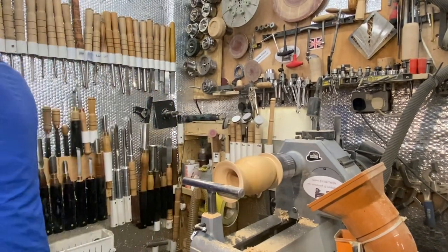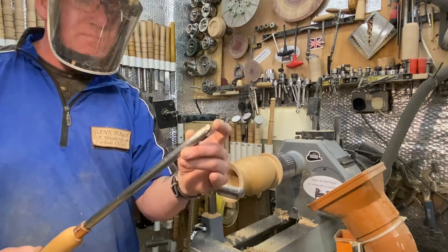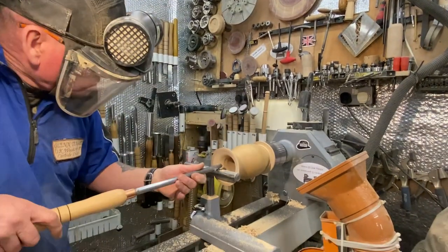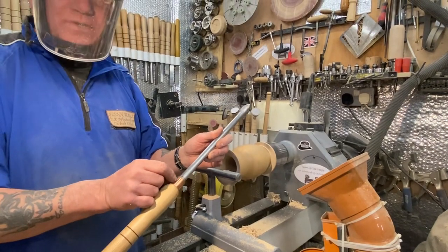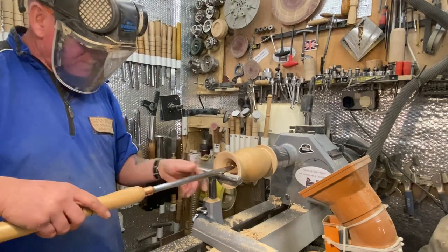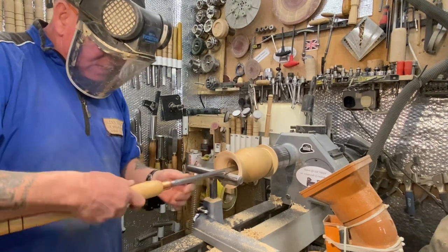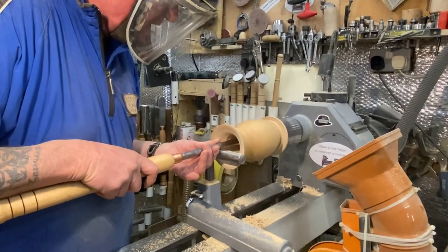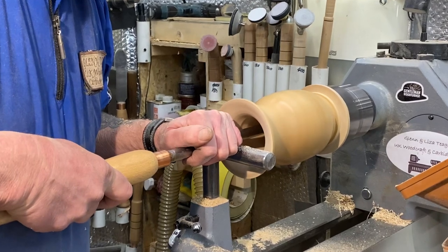But for me, when I'm doing deep hollowing, I prefer the 10mm AU on the Rambo deep hollower. This one can come in. What I suggest is you put a mark on your ferrule so you can see which way is up, because you don't want to go in with it straight up. Believe me, when it's down there on the Rambo, you can't remember where it is. So at least this way, I can close it so it can't do any catching. It can't cut, look, it can't do nothing. And then I'll just bring it gently in. There we are.